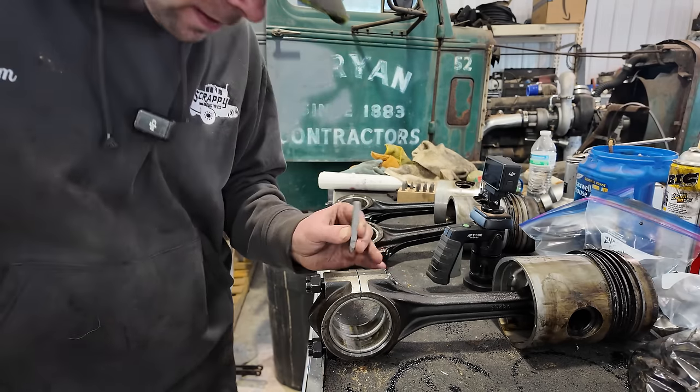This is one of our liners as it came out of the washer. I quickly scraped it off and let it wash some more, and we're really close. We've got a little bit more carbon to get out of the top. I ran my knife on the inside edge of the lip at the top of the liner. I want to clean up the rust under the flange on the bottom side, and at the O-ring area there's a little cleanup to do, but all in all not bad. So far I haven't noticed any pitting, cavitation issues, or anything major — just minor pieces here and there. Nothing to worry about.